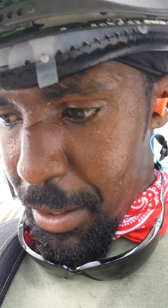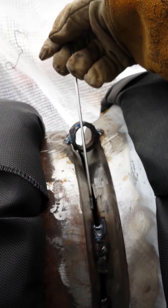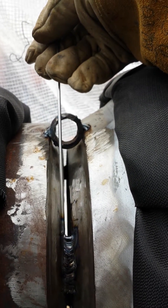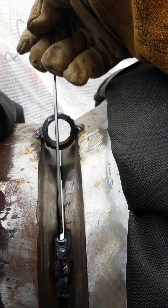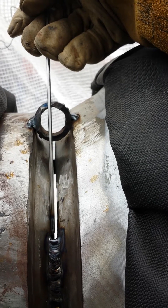Let me go ahead and run a little bit of this wire right here. That's the motion right there — side to side, that's all you do. Side to side. You want to keep that rod a little bit below the bevel, side to side, inside the pipe. It's almost like back and forth. I'm going to show you exactly how to do it.